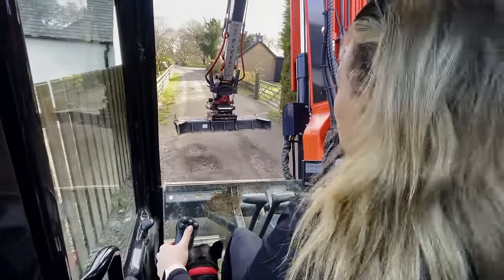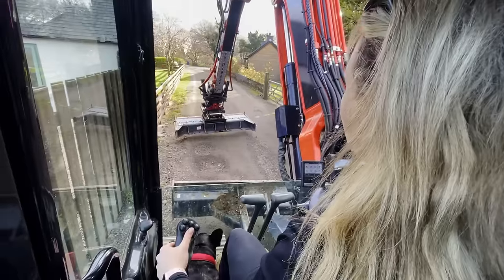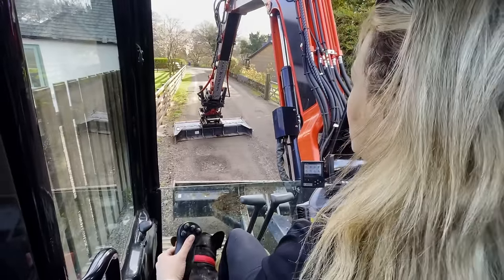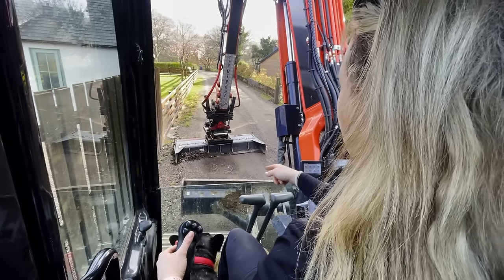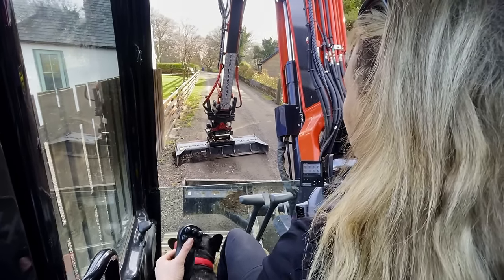And when you are doing a road or that and you're getting potholes, it's because there's not enough shape in it. The water needs somewhere to run off. Someone's put more planings on top of this, so this is not my original shaping.